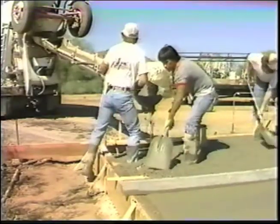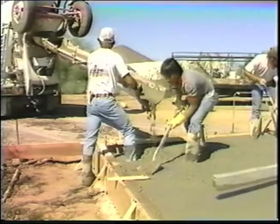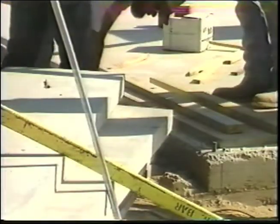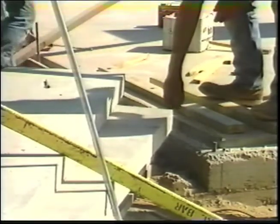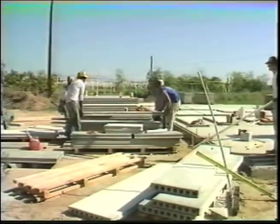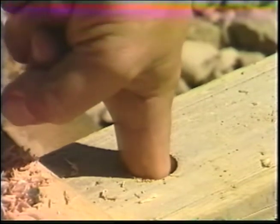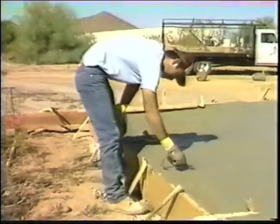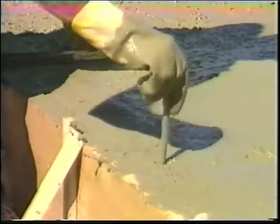As the foundation is poured, it is extremely important to move the concrete under the 2x4 channel to ensure proper leveling. When the concrete is nearly dry, the 2x4 is removed, leaving a 2x4 channel which provides a lowered seat for placement of the fiber panels. After the slab is floated, a 1-inch hole is drilled in the wood or metal stud, and the J-bolt and 3/8-inch coupling nut is inserted in the concrete. The threaded coupling remains above the foundation level.